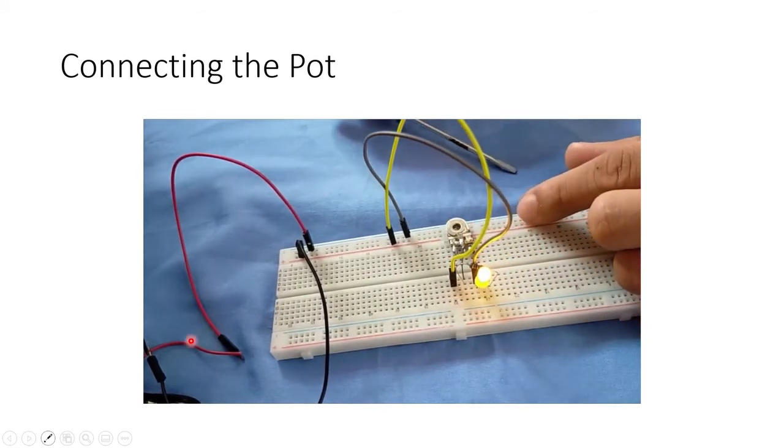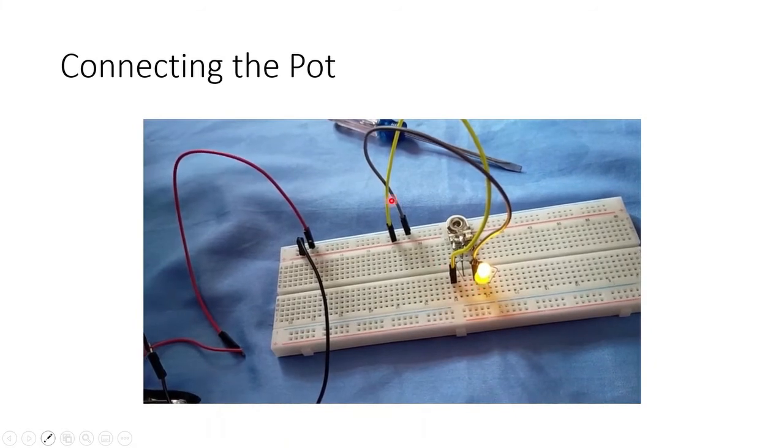So what happened? When we reversed the connection, or when we transferred the LED, we made our pot change the voltage, going to the minimum when we turn it clockwise. When we go counterclockwise, we are choosing the maximum voltage, so we are increasing the voltage up to 9 volts. See the effect? Now, how does it do it?